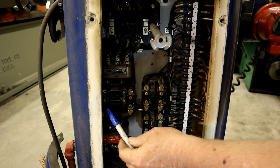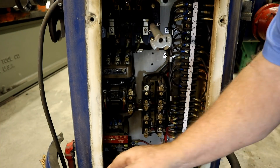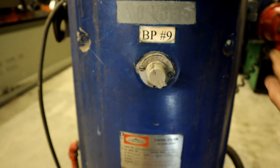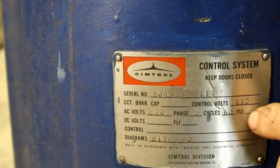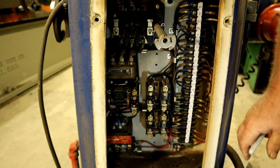These are all heaters in this machine - they only have two heaters per motor, not three like a modern one does. There's also a heater here and a heater there, so we have three sets of heaters that have to be changed. These are General Electric heaters and there's a chart listing online to figure out what sizes they are and what they need to be. Down here it clearly says this was a 220 three-phase machine. Now it is again, but for a long time it has been a very unsafe 440.